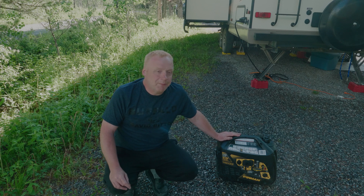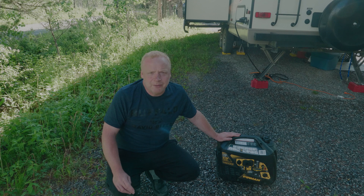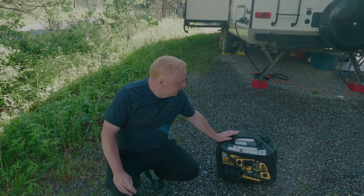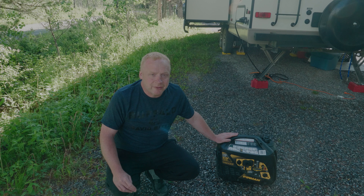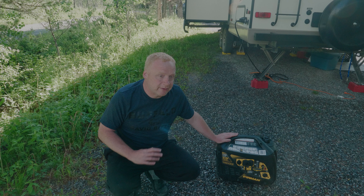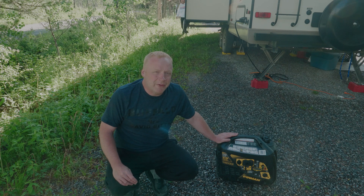During a rainstorm people are inside their trailers and won't hear it anyway. We bought a 1,700-watt unit — in Alberta you don't need air conditioning much, so there's not much need for a 3,000-watt generator. We have actually been able to run the air conditioning with it, but it maxes it out, gets really loud, and you have to be careful how you start it — so it's not recommended.